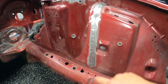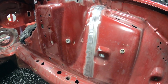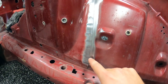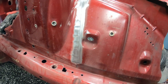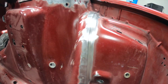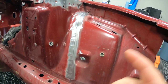We need to get all the seams nice and clean with no contaminants where we plan to weld — on the outer surface, the bottom surface, and the seam itself. I'm going for half an inch to an inch of clean surface on either side of the seam, because the weld heats up the whole area and if you have paint too close it'll heat up, burn, and contaminate the weld. The end result is nice clean metal with no primer and no seam sealer left. Sometimes you'll need to use a pick to scrape out or heat stubborn material.